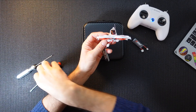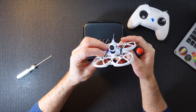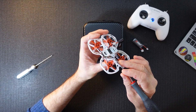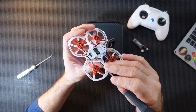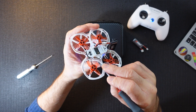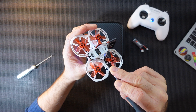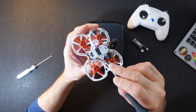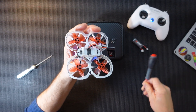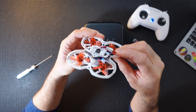What you need when you press the bind button - it's very small - press it only once. You will hear it click; there will be a slight click when you press this. The blue light will go solid and the red will carry on flashing. There we go - hopefully you can see that: blue's gone solid and the pink is still flashing.